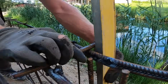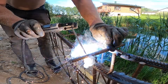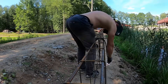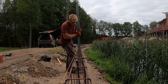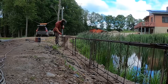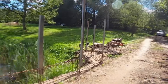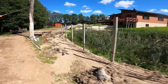As everything is locked solid we can install the top spacer on each pile. We set it plumb with the bottom spacer because together they show the exact edge of the wall, and we repeat the same process on all the piles. These piles act as our locking points — once the cages are tied to them nothing can move. The last step before the formwork is installing the steel posts for the railing. Putting them in now makes life easier because we can set them in a straight line and lock them in so they won't shift during the pour. You'll notice the tops are uneven but we'll cut them all to the same height later once the wall is built and the road is extended.